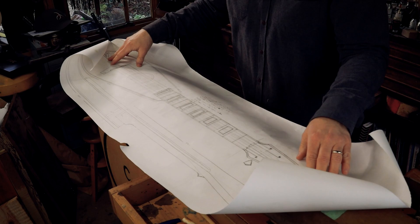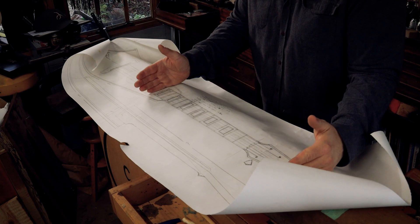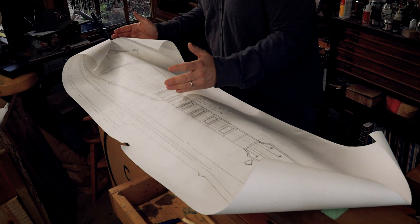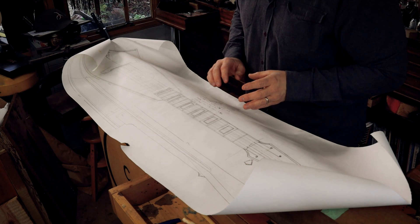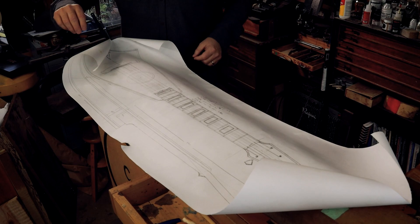So we have our cut list and what I want to do is essentially chop the piece of wood in half so that it's a little bit easier to work with. The neck and the sides should all be roughly the same length, which is going to make this much better. I also want to see what the grain is doing so I can figure out which orientation — I want it to be quarter sawn as much as possible.